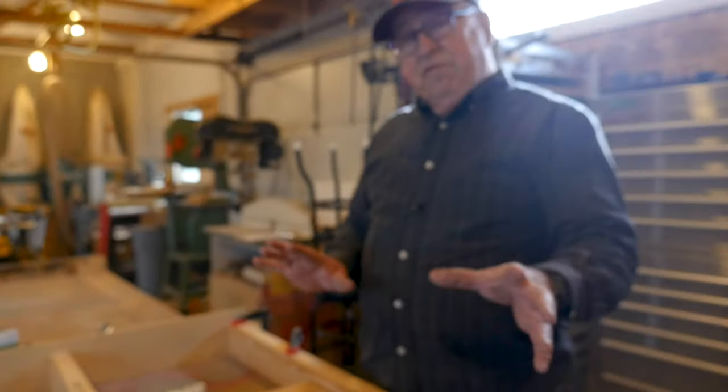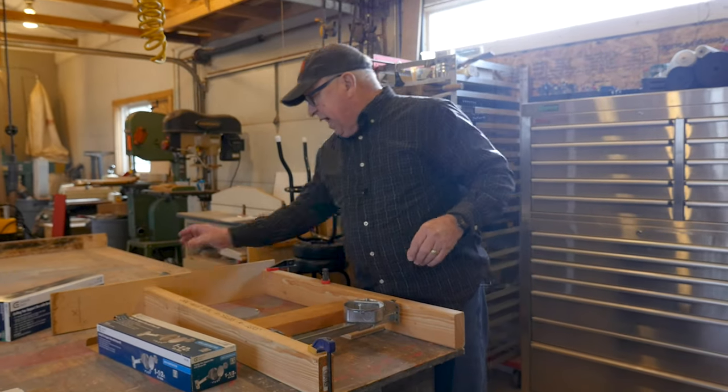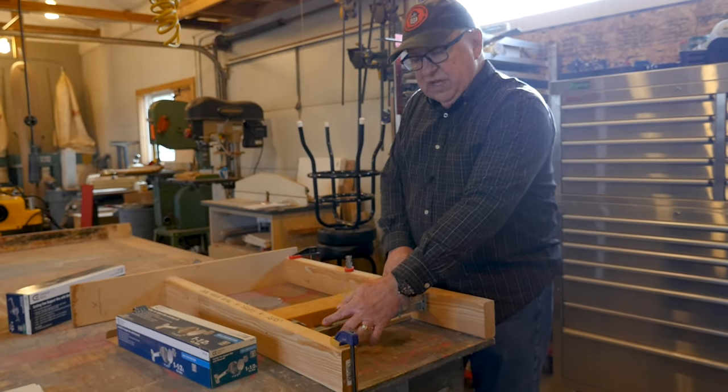So now you know how this is done for new construction. Three approaches: direct mount on a ladder block, a side-saddle that goes on the joist, rafter, or truss bottom cord, or this sliding bracket device.